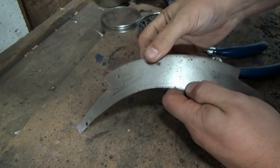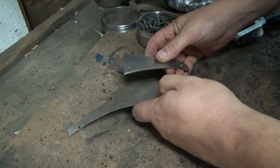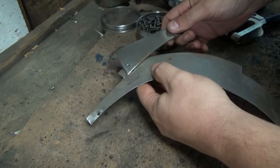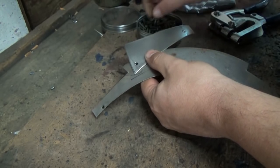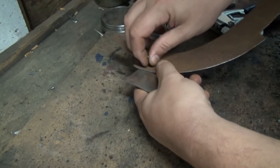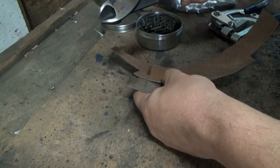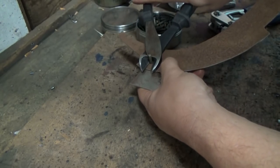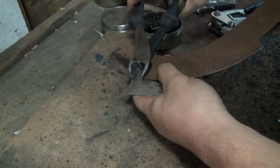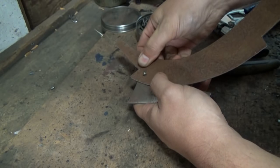In this first instance all I'm going to do is stick this piece of metal to that piece of metal. It's a really simple operation but it's absolutely key and fundamental to just about any piece of armour you're likely to make. Certainly if it's medieval, you'll see riveting right back through into antiquity. You take two pieces, drop the right size rivet through both of them, and then stick them together. Obviously you can't just rivet straight on there — you need to cut that down. I've got a set of snips here; I prefer these sideways snips. You offer it up hard against the material, then just lift it up a touch. There will be tons of advice online about what ratio this should be — just get a feel for it and you'll soon know. Then just snip that off.